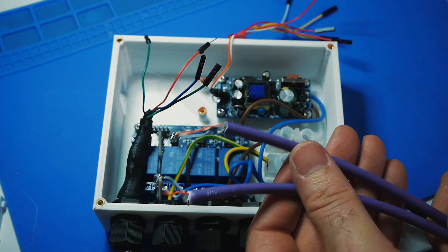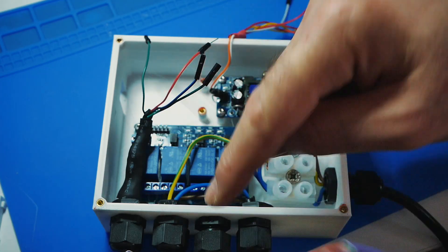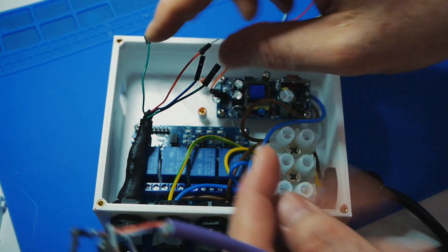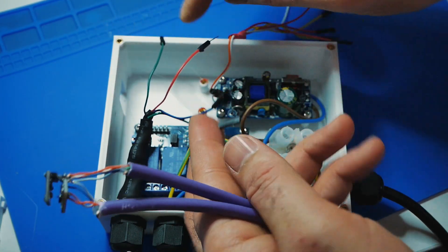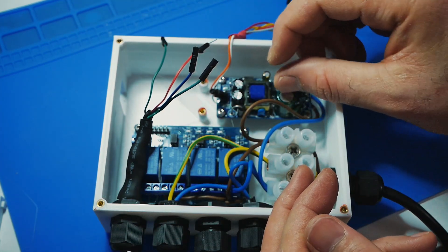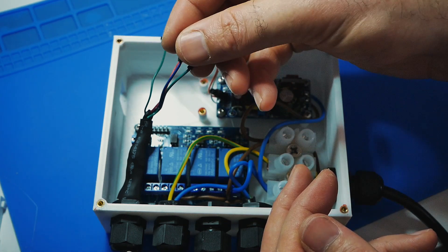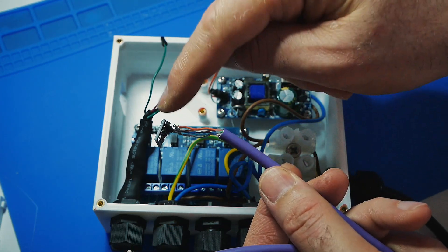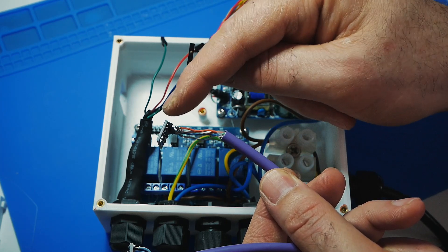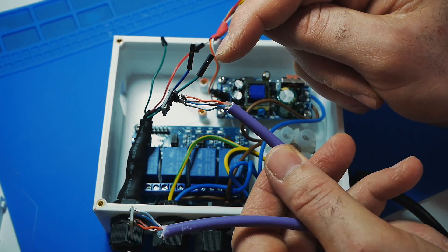Over here are the two BME280s — I have them all connected together, so all these four pins are connected to these four pins, and they'll come through on this network cabling. I have about one and a half meters of it, and they're all connected here, which is why you only have four inputs. We have power, ground, SDA, and SCL, and those will be plugged into the power source over here as well as the ESP32 for the SDA and SCL. Just remember, you need to change the address on one of the BME280s or else you're going to have a conflict. Have a look at the previous video I did showing you how to run two BME280s on the same bus and you should have no problem.